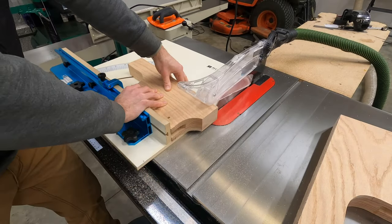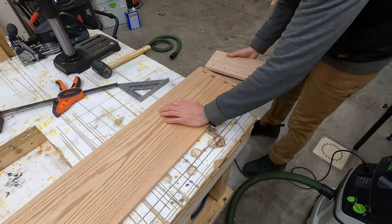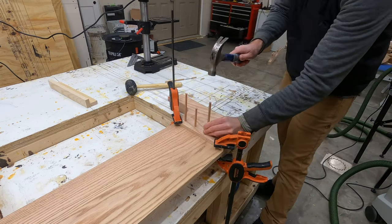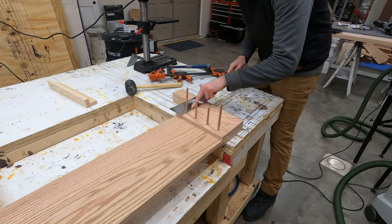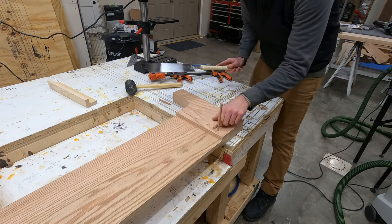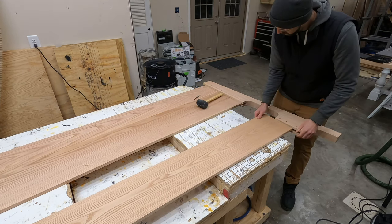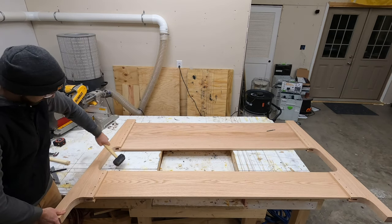I can pin those holes similar to how you would do breadboards on a tabletop. Before doing that, I cut the excess off the table leg — I thought about leaving the curved edge, but didn't care for the look, so I cut it flush with the top of the panel. Dowels can then be hammered into the hole and also into the slot all the way through. I decided to leave them as a dry fit rather than using glue — I wanted to see how they hold up over time. Since this bed frame is for myself, I'll be able to monitor the wood movement and fix anything that goes wrong.